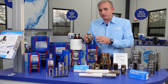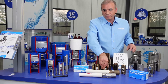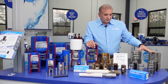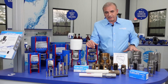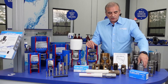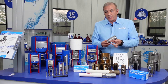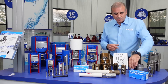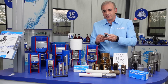We also offer the WCR poppet, which is a free-floating poppet that is very forgiving with any type of dirt, debris, and sand. These WCR poppets can handle up to five percent sand solution in the well, so they're very resistant to different types of debris and sticking. We also offer them in 316 stainless steel — the ADS6 or ADS6 VFD style check valve — all 316 stainless steel design, as well as a 304 stainless steel design, including our 100 MSS VFD style and the regular 100 SS2 standard WCR poppet design.